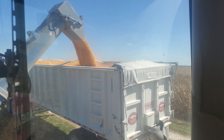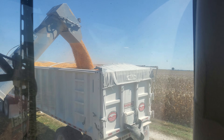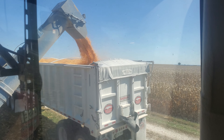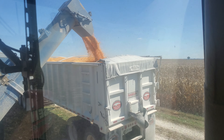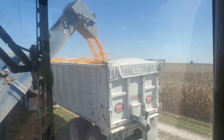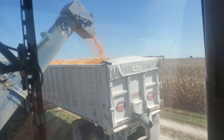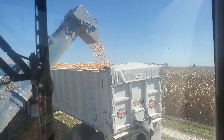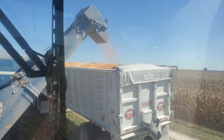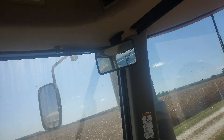So we're about full. That gate switch — the belt, the gate switch — once it kind of reaches full, I'm going to flip that and pull up. That's going to fill that last little load. If I wanted to add a little bit more, I'd bump that open, but I think that's pretty good. I like that. I'm going to give it some throttle, rev it up — it's just going to clean out that auger a little bit. There we go. That's pretty good. We'll take it back down to idle.